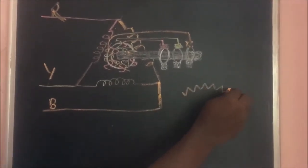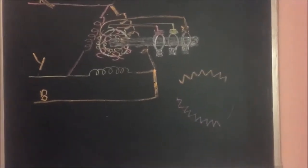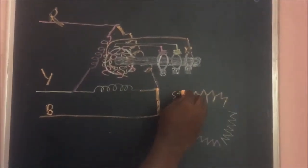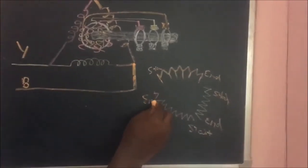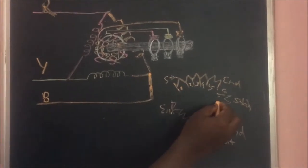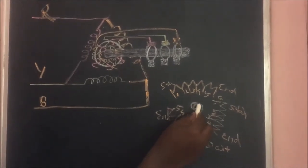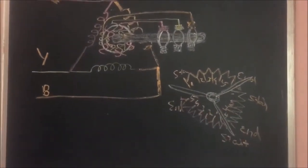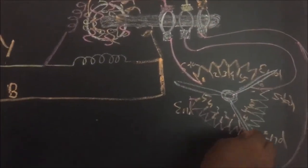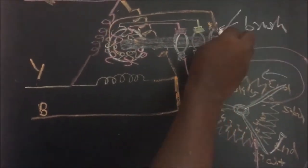At the center we have a shaft. The shaft consists of three slip rings. Slip rings are made up of copper. Each slip ring has brushes on top and bottom separately. Now for the rotor resistance starter diagram, you have to make a circle and draw three sets of rheostats. Mark starting and ending terminals for three sets of rheostats, then number them one, two, three, four, five, six in a clockwise direction for all rheostats.